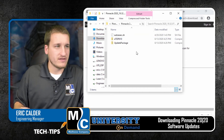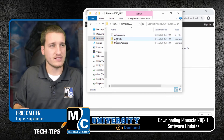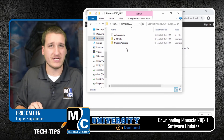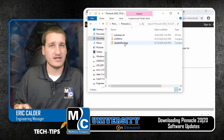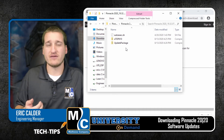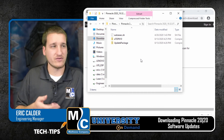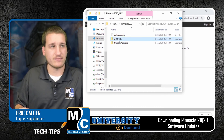We'll open that file until we see the three folders you see here. One of them is an autoexec file, then you have an etop610 and an update package. This update package is actually the one for the 7.10 screen. If you have a 7.10 screen that you're updating, when you put the USB in the back, this will automatically boot and update your HMI. If you're using this same USB to update a 6.10 screen, the autoexec won't start it. You'll want to put the USB in the back, navigate to update HMI on the service menu just like you normally would, and then navigate through the browser to this file here — etop610.